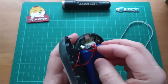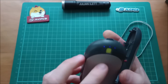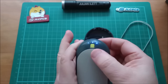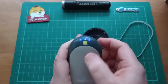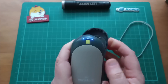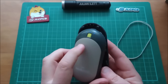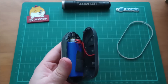I'll show you the fault as it is now. If I plug the battery back in, you've got three blue LEDs here and normally that would tell you how full the battery is. It isn't, because the battery is actually quite empty now. No amount of button pressing or pressing and holding does anything now. And if I leave this for any length of time — it's not so bad now because the battery is down to about 2.8 volts — but something was getting hot and something was smelling a bit electrical.